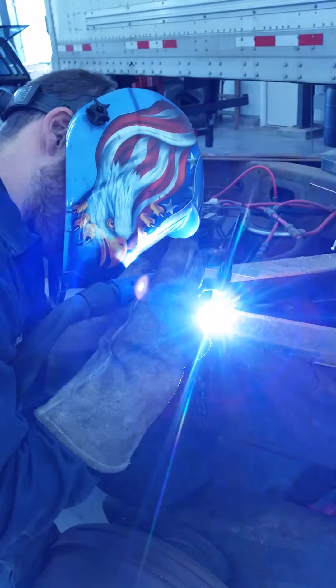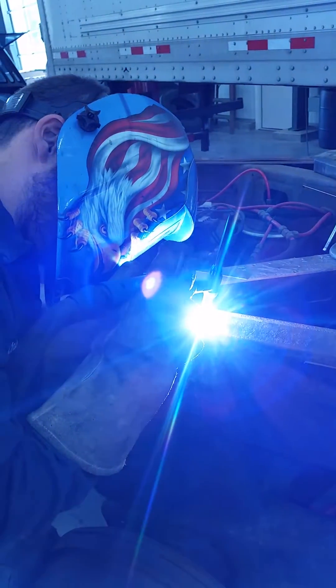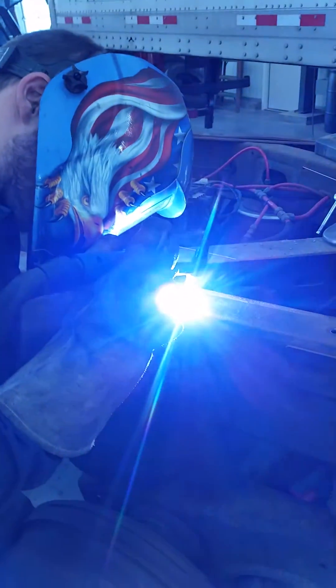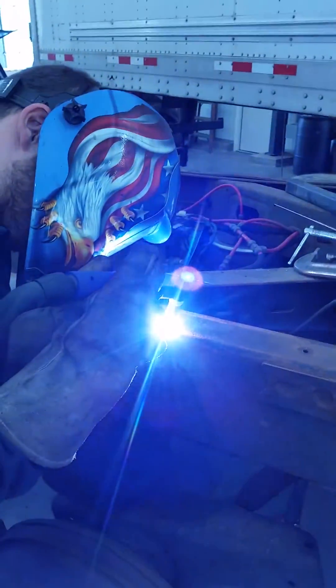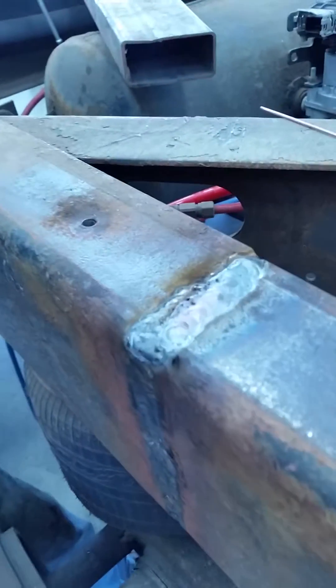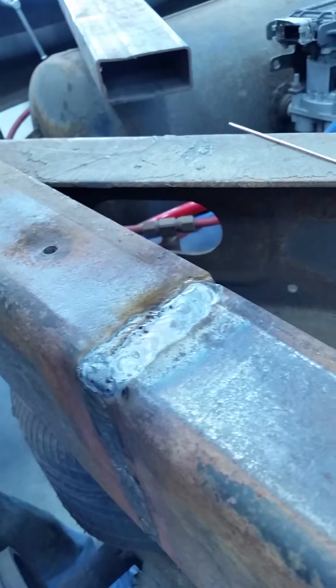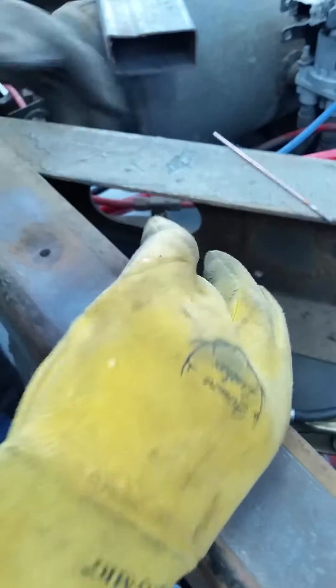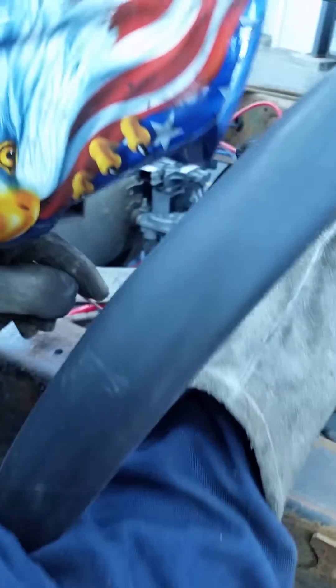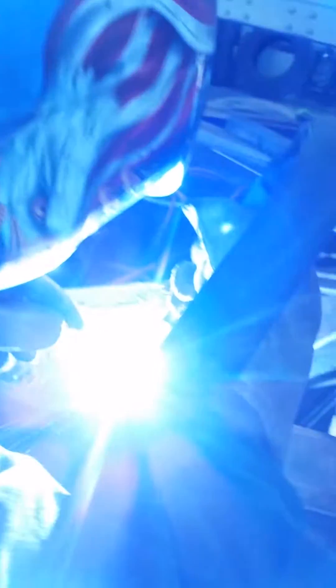I'm going to go right up on this side. There's the way you do it — you're pulling it back, then I'll move it, put it right now. Now you can hit the inside. You can go a little more on this edge too, to fill that up nice. Just go nice and easy, you can point right here, add the filler rod right here, kind of go at an angle, but don't take it in because it'll dimple in on you if you're going too slow. It's nice when you've got the throttle pedal — go right in there, hold it nice and steady.